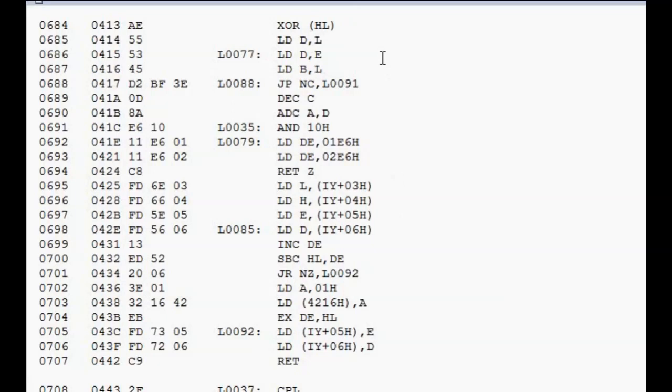So for example, if I monitored the write line for that SRAM and then captured on that with a logic analyzer, I could look at the address that was on the data bus at that time, and that would tell me the address that the CPU mapped that device to. Because obviously a secondary issue here is that while we have 64K of user RAM, it all has to reside within one 64K block, including the ROM and the stack RAM and the trace memory. And it does that in a fairly clever way.